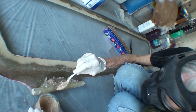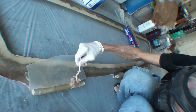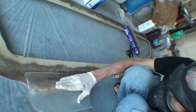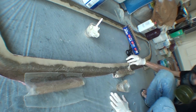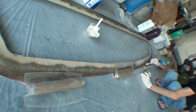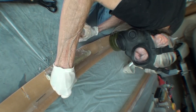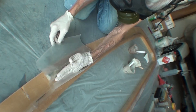All of that has hardened now, and I'm going to put on even more thickened resin — thickened resin with a lot of pieces of chopped-up fiberglass in it. I'm using wax paper as a release film so I can smooth it really smooth with my hands. The wax paper will make a fairly smooth surface so I have a lot less sanding to do later. It's like peel ply for somebody who's too cheap to buy a whole roll of peel ply — wax paper is nowhere near as good as peel ply, but it sort of works sometimes.